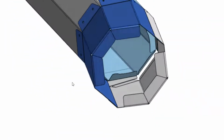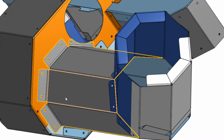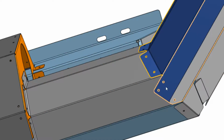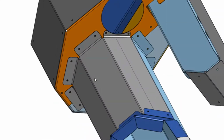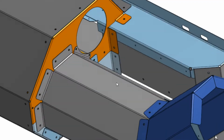Let's see. Here we go. With that bottom piece in place, you can bend the top part of the exhaust pipe cover into this octagon shape. Notice the way it's oriented, it tapers down at this end, and these flanges bend out 90 degrees at this end. It is also a fraction of an octagon, probably 4 faces of it. It overlaps the piece underneath, and we'll screw onto the housing here. You can also match up this curved cutout on this flange with the air entry hole in the side of the exhaust turbine cover.